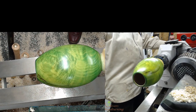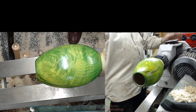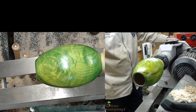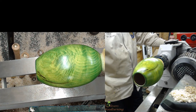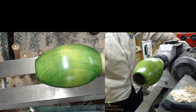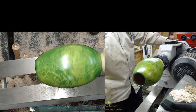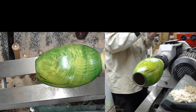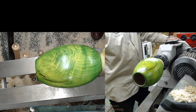Oh, curly maple. Spot on. That will look stunning. Just two colours, though. If you've got a lot of figure in the wood, just two colours. Normally I build them up and I'll have 6-7 colours in there, but that just has a real lacy sheen to it everywhere as well. Just two colours. But apply the first colour a few times so the softer area it sinks into further and then you get this tonal effect to the colour. It looks, I don't know, yeah, smart. Two colours.